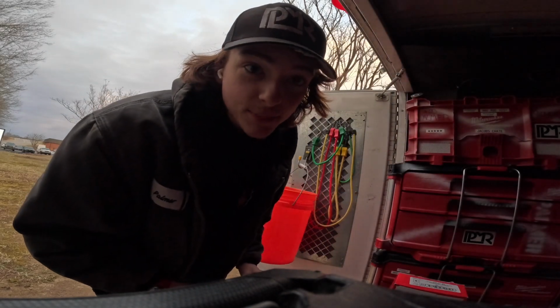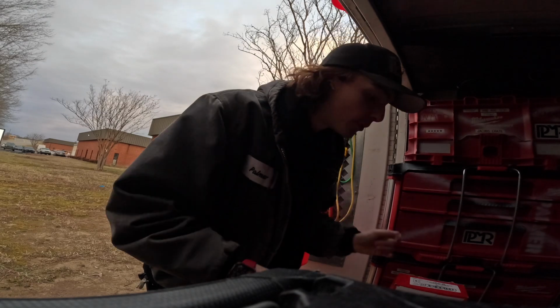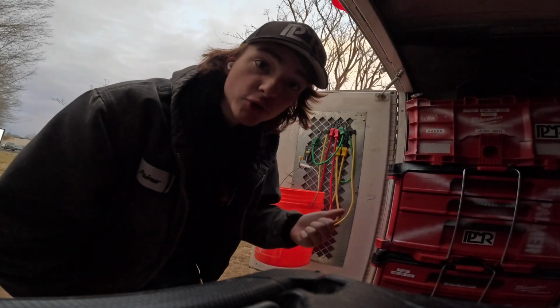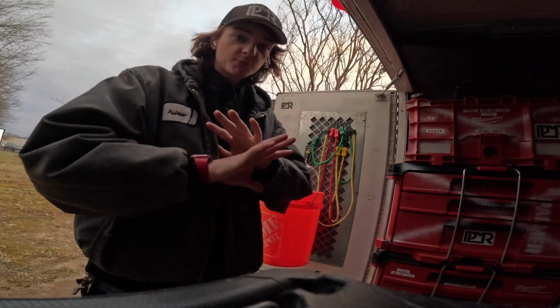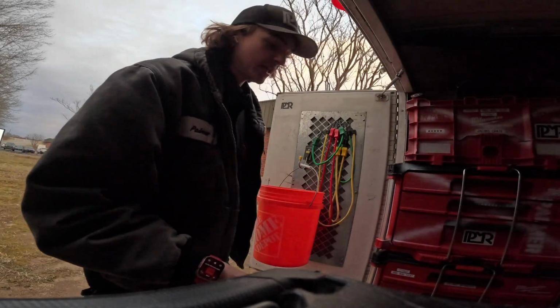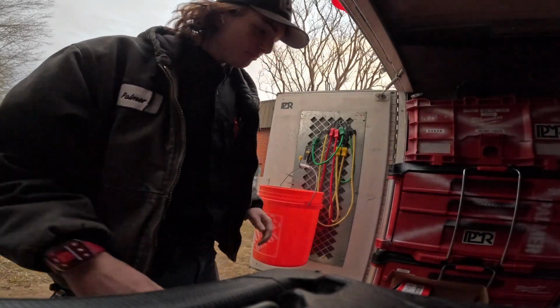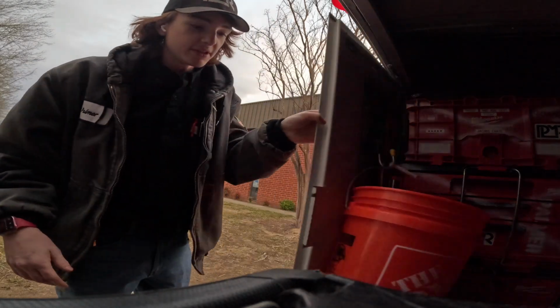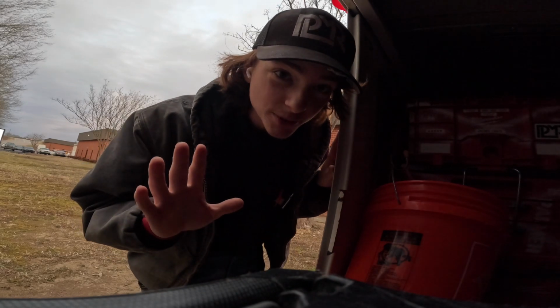We just stopped by the supply house here to pick up some materials for today's job. We've got an interesting one today. We're pulling two new 120 volt circuits for just dedicated receptacles in the crawl space for a new sump pump and a dehumidifier the customers are having installed. They're having their crawl space totally encapsulated, and those two pieces of equipment will help keep the crawl space dry and free of mold and pests and all that good stuff. Everybody loves an encapsulated crawl space, and I'm happy to contribute.